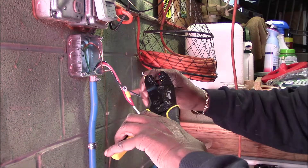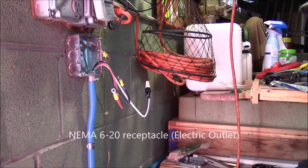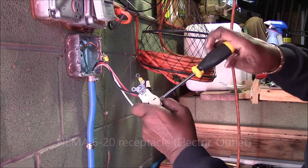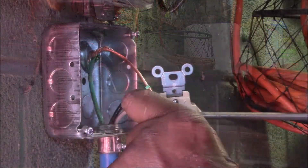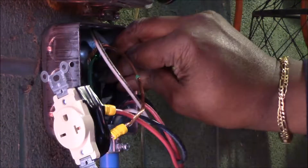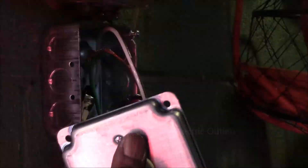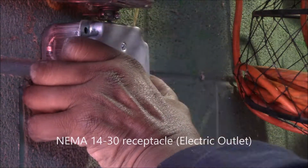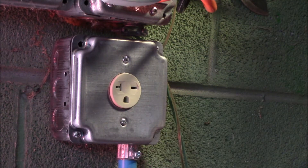In this part of the video I actually installed a 6-20 outlet connected to a 20 amp breaker in the house. Then I made changes to bring out 30 amps rather than 20 amps, which means the outlet will change from a 6-20 to a NEMA 14-30 receptacle. That way it puts more amperage out to the garage, which would allow me to charge my electric vehicle faster — 30 amp versus 20 amp.